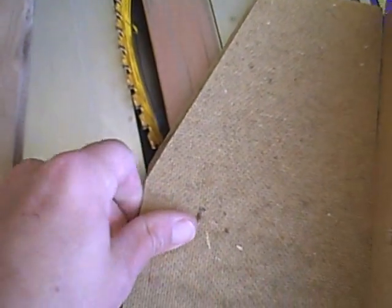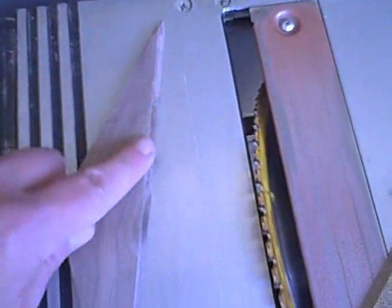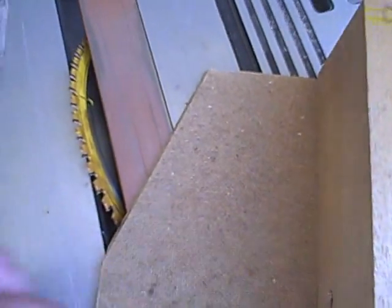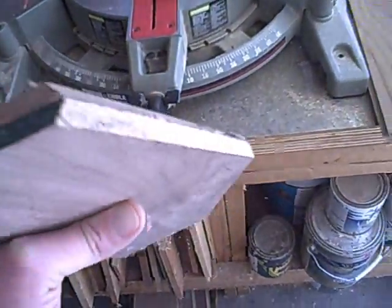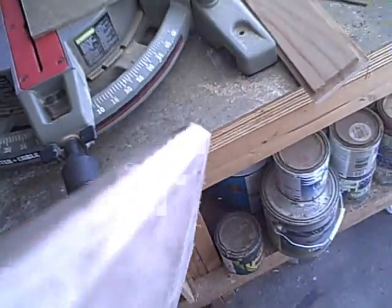I'm running some tests right now and I need to cut the angle part first. I've left this board really wide because I discovered that I need to cut the long side last, and if I leave it wide, that'll give me room to run it along the fence safely. Here are my two pieces — the weird part is I put them back to back, and of course I've got the bevels on this side, and going around there are inside bevels here. That was the part that was causing me trouble: getting those bevels going in opposite directions. But I think I got it now.